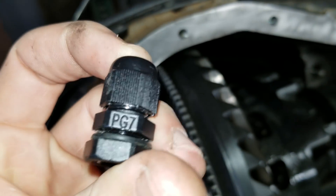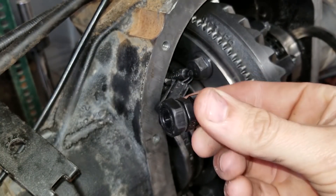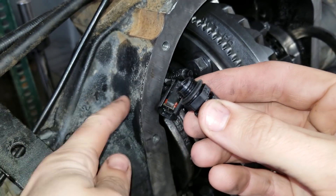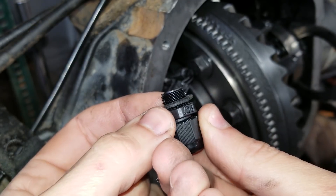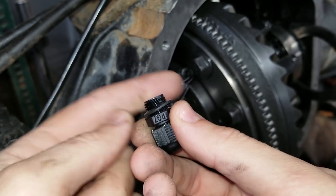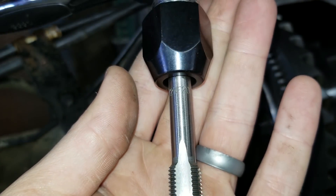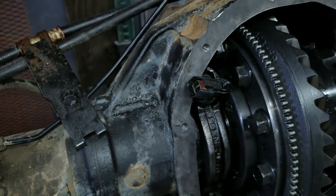It's IP68, so it's waterproof, and this is the PG-7 size. First step is to figure out where we want to put our cable gland. These are technically meant to mount in sheet metal panels, but this is obviously way thicker, so we're just going to tap it. I believe that's an M12 by 1.5 thread — I'm going to verify that and then drill and tap for this cable gland. It turns out that is a half-inch 20 thread, which is mighty friendly of them, so let's get to drilling and tapping.